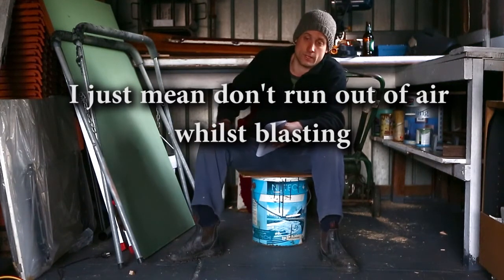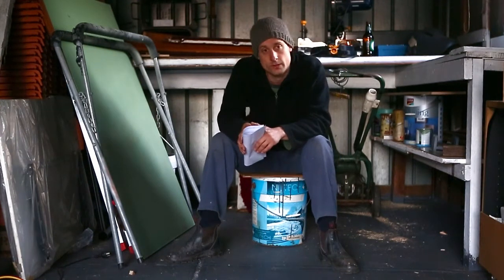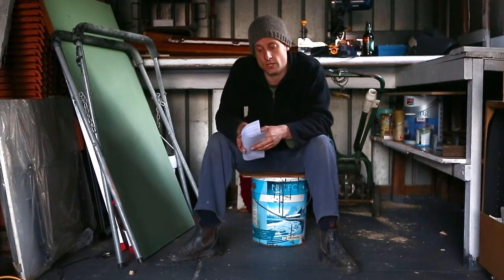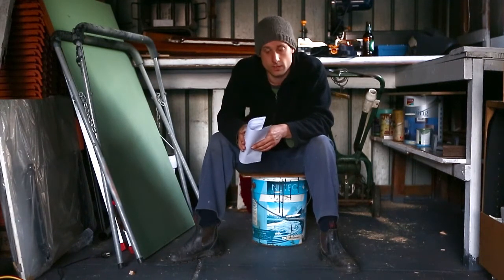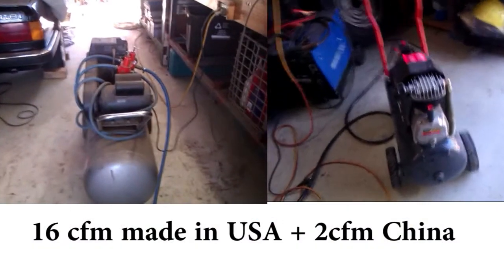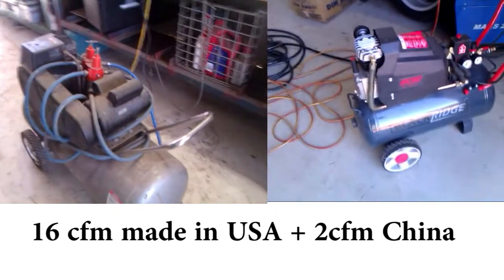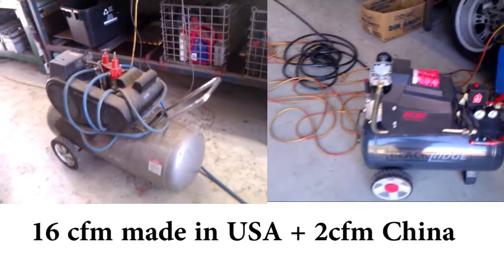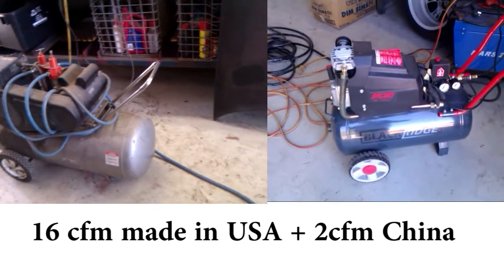After I got all my work done — using worn-out ceramic tips that were way too big and having a really hard time — I found a really good chart. It gives you ratios so you can cross-reference how much air you've got and exactly what kind of tip you want. I'll put it in the notes. For me with 18 CFM, I wanted to blast at about 100 psi — that wasn't going to happen, I was hoping for 90. What I really needed was a 3mm tip to maintain that pressure with the volume I could produce.